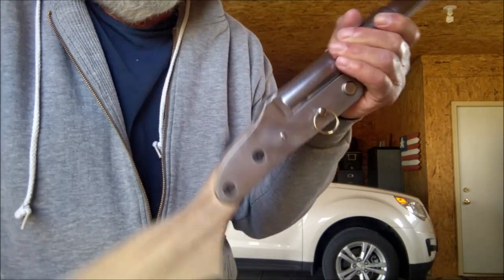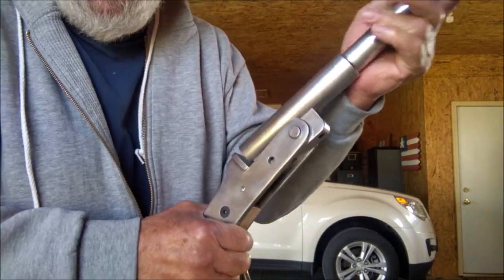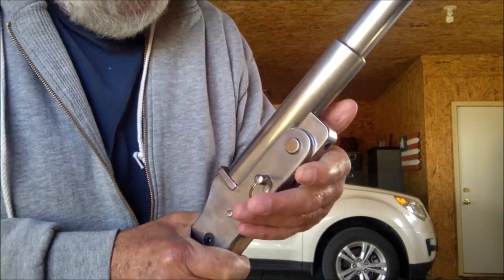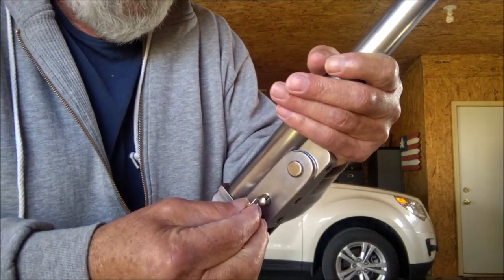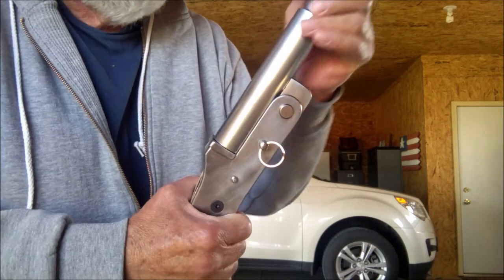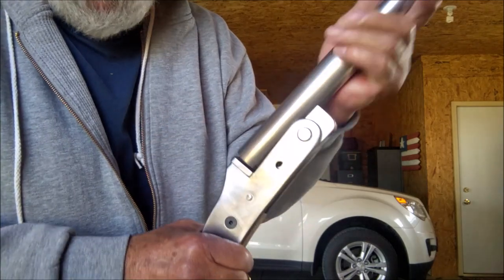I've got the stock roughed out. And for the barrel lock, I discovered that if you use an old tapered pin, it just works great — it locks up tight as a drum. It's easy, it's quick, and I highly recommend it. We were getting rid of some stuff at work and there was a box of tapered pins that were going to get thrown out. So I grabbed a couple of them, dug around, and found a tapered reamer that fit them, and used that to put that barrel lock in. It works excellent.